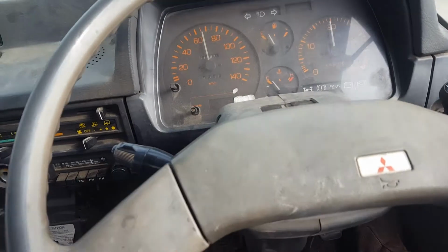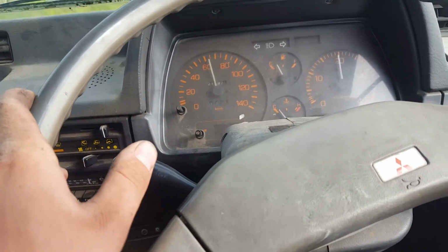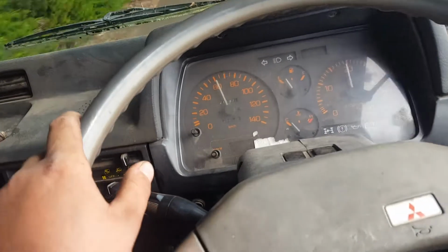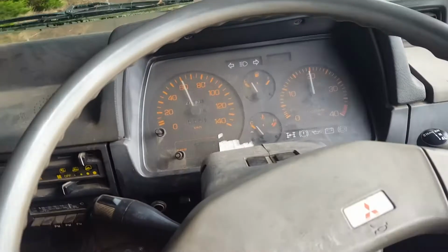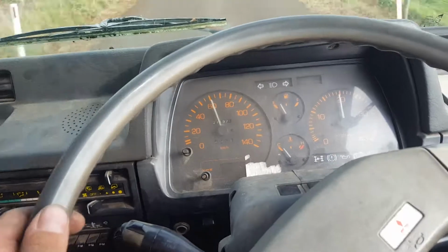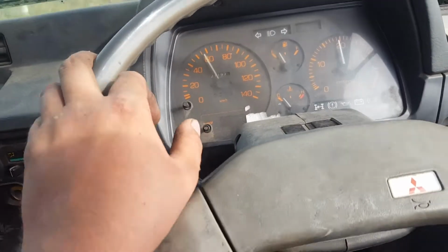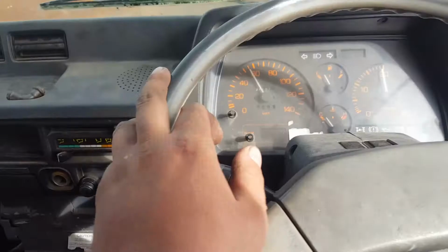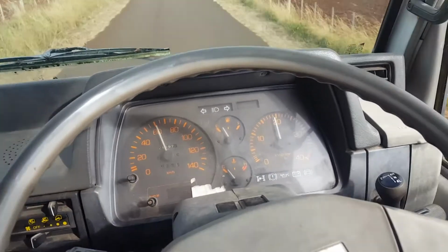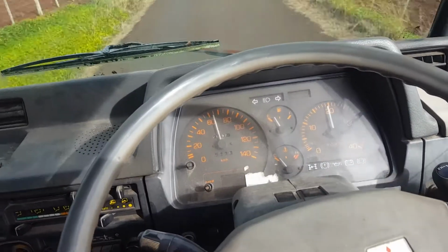So it's just feeling really low and sluggish. Doesn't get hot, which is good. Means the clutch fan and everything's working well. It's certainly rolling better. A bit bumpier, of course, but that's probably why the previous operator may have let the air pressure out. We had 38 pound in the front left, 40 in the front right, 20 on the inner 2 tyres at the rear, and about 35 on the outers. So we put all 4 rears at 70, put the fronts up to 80. Fronts are capable of up to 107.